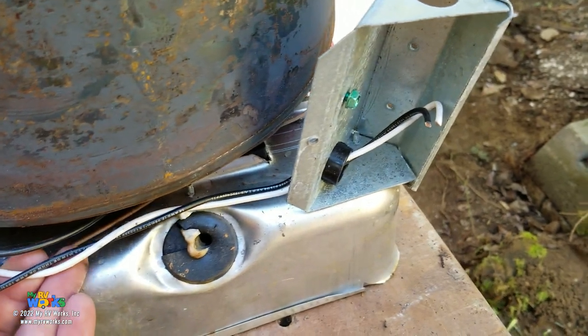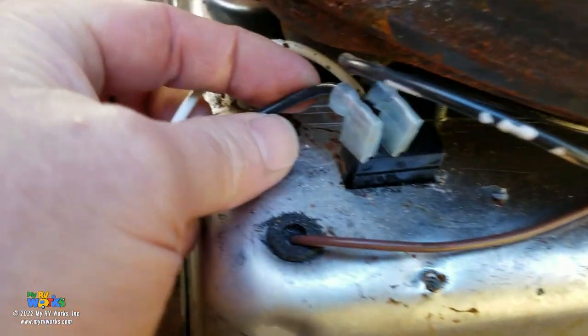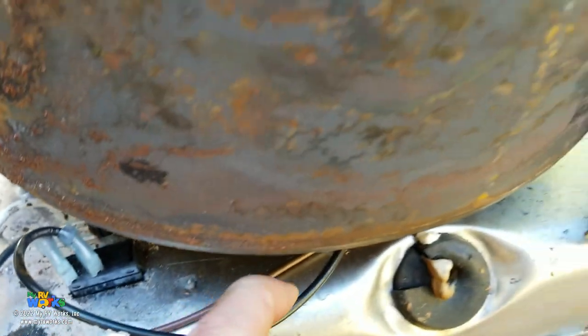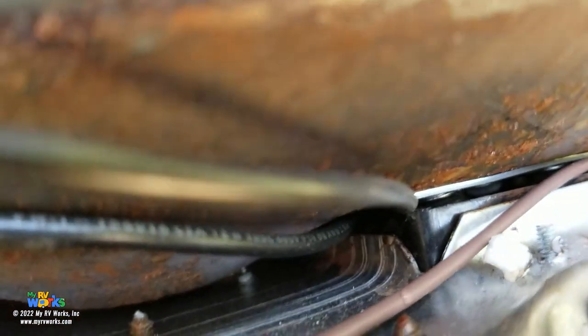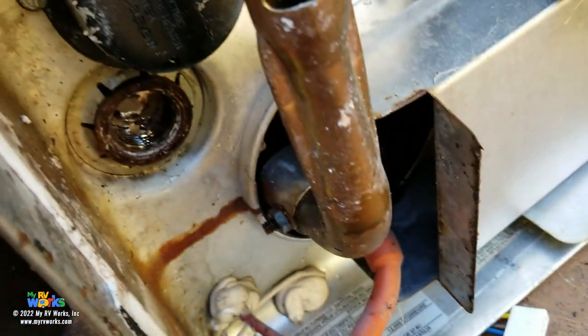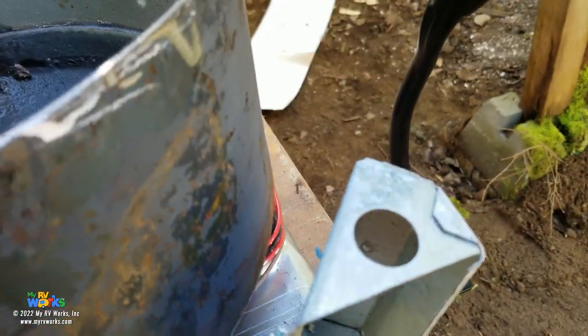Remember we talked about how that's a junction box? Okay, and look here. One wire comes into our switch and then leaves our switch, and guess where it goes? Let me turn this up a little bit. It looks like it might be a little pinched, but it's going to go to that thermostat, okay? And it'll make it through the thermostat to the heating element. Again, that's all here on the front, okay? So let's see here. Let me hand this back over to Dakota.